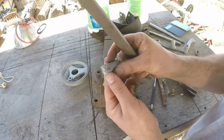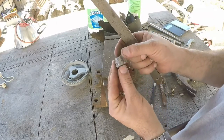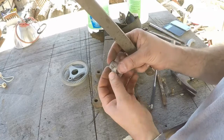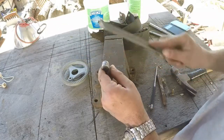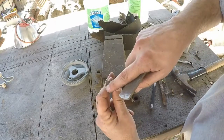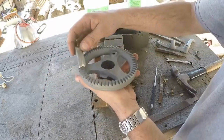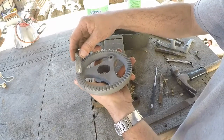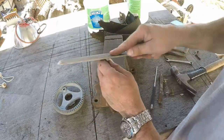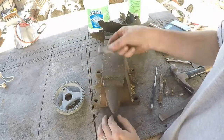You can kind of see high and low spots going on here — there's a little recess right there. This is a little bit spotty on whether this would come out of the mold pretty easily. I don't think it would be a huge problem but you definitely want to try to get it as good as you can. You can see where it's worn — that's where this thing has been landing for the last century or so. Maybe I should just leave that and chamfer this back the rest of the way, and that'll make it fit really good. We'll call that good for prep.